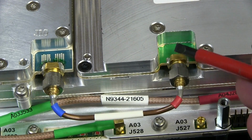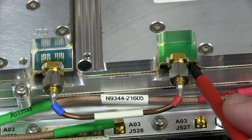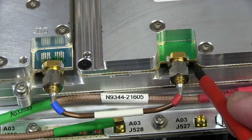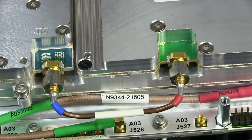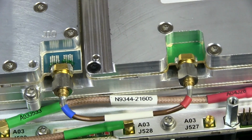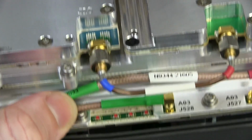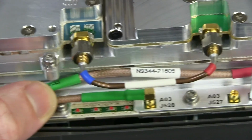The pin's on the top side, and it goes direct. The center pin is on the bottom side of the board here, and that's connected directly to the correct width trace on the bottom side of the board. So there's no pin which comes out and then goes right angle down like that, because, well, at 20 gig, that sort of stuff matters. So look down in here. Looks like we have some status LEDs down there.